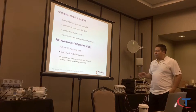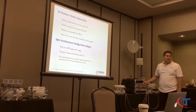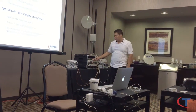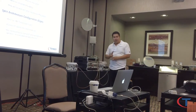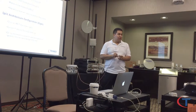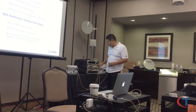Connect the IF cable to the IDU before powering up. Right now I'm safe to connect and disconnect my cable. But if I power up the IDU and then plug it in, I run the risk of creating a short circuit on the IF cable. If the center connector touches the outer connector, it's going to short and blow my end connector fuse.